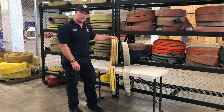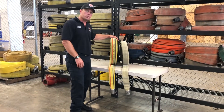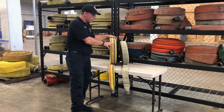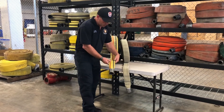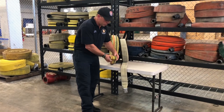One of the things you get with this hose is, number one, it doesn't lay down as flat. Our crosslay loads and flat loads — you're seeing how they're stacking up a lot taller now. Look at these rolls — these are both 50-foot rolls, where this combat-ready hose stacks up bigger. It's not quite as flimsy, so when you fold it over, it's not going to lay down as flat.